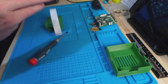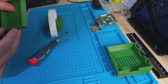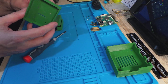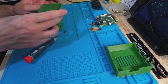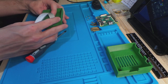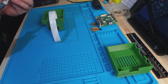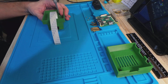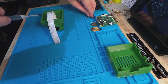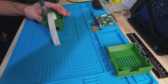I'm not going to do that yet because I'm going to attach the Pi base now. Make sure you get this around the right way — that is the SD card slot, so that goes to the bottom. The cable goes through, the screw holes are lined up, and now we actually screw these in. Again, don't do them tightly at first so you can adjust things.